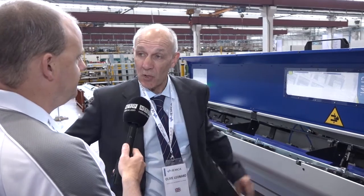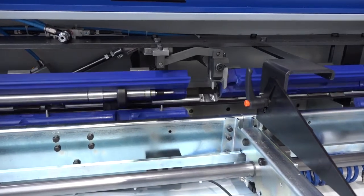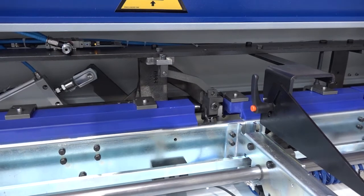The 52 has a 300 millimeter capacity magazine. This isn't just for long production runs - with the HD model, even for subcontractors, the changeover time when changing from one bar to another with the same guide channel is less than a minute. Many people opt for short bar magazines, but they could be making a major mistake. A lot of consideration goes into the machine tool, and then people just tick a box for bar feed.